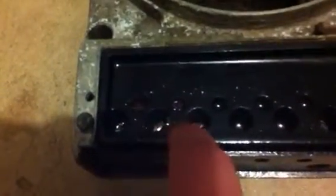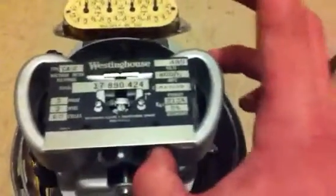You can see it's 400 to 5 amps, which is 480 volt, even though it only has a hot and hot, so it's just a split single phase meter. But it's a CT because you have your CT blocks there. It has one of these old-fashioned type braking magnets and interestingly it has two discs, but it's in a regular form factor.